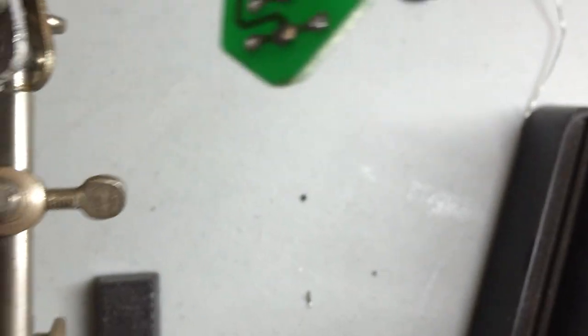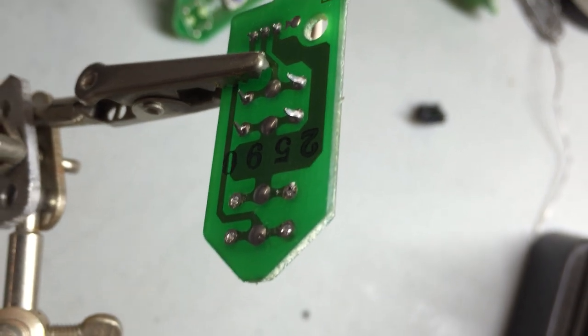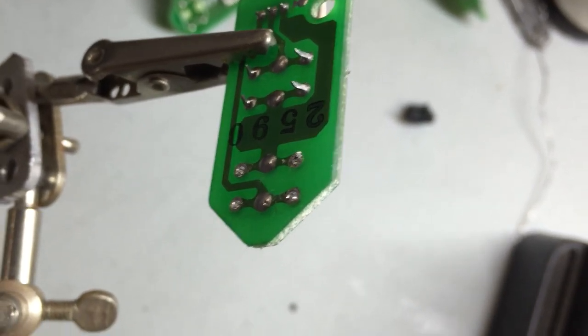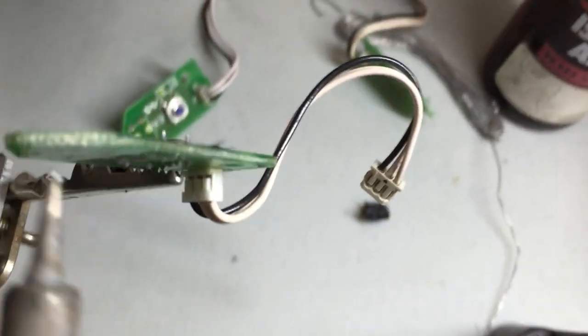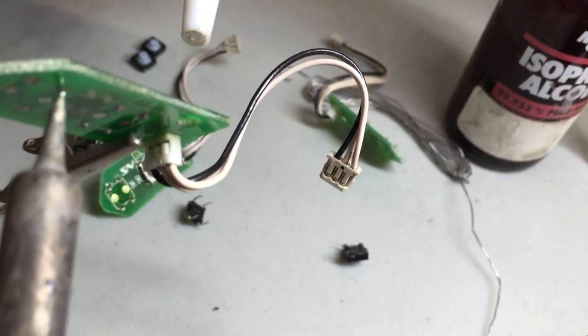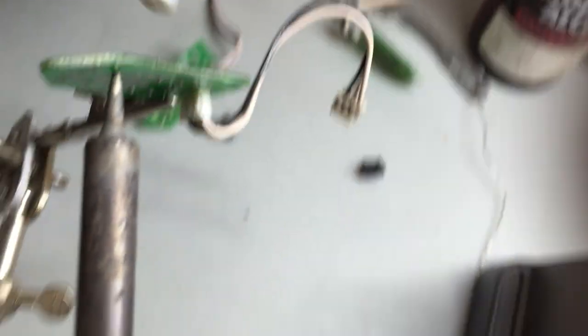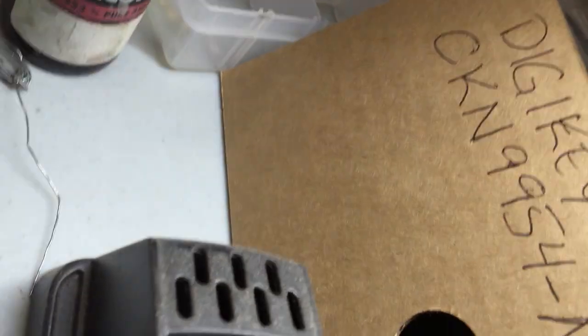We have another device that's designed to suction the hot solder out. This is a real common tool here where it's a plunger — like a little vacuum. It creates a little vacuum; you plunge it down. I'm going to heat it through the hole where that little leg was right here. Let me get the solder iron lined up on the hole like so. Put the suction device right there, push the button, and it releases it — and it sucks the solder out of the holes in the circuit board.